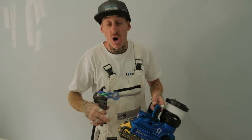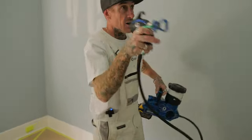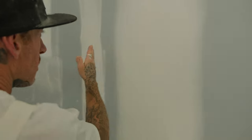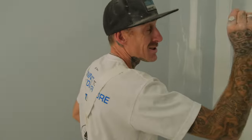The 308 runs perfectly through the Quick Shot — this is one of the tips I'll be using a lot, spraying out intricate woodwork without dragging leads through property. You can just carry it around and spray out all your woodwork. See the difference in atomization — where it fades out nicely on each side without any thick edges or sharp stops — that tells you it's the right pressure for the application, material, and machine. Now we're going to put in the 408 and see how it sprays.